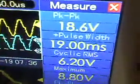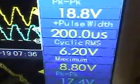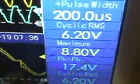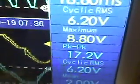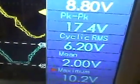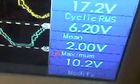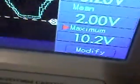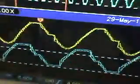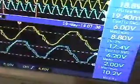Right, and this oscilloscope is interesting because now we're getting 18.6 volts peak to peak. This is the yellow channel. Cyclic RMS is at 6.2 volts. Maximum 8.8 volts. The blue, 17.4 volts, RMS 6.2, mean 2, maximum 10.4, and that's the waveform. Under load, my trigger needs moving a bit, I think.